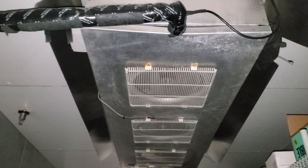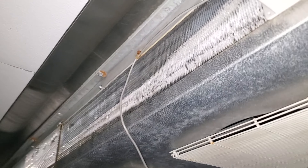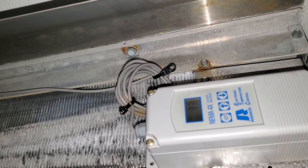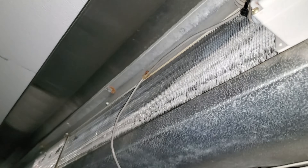We have been called on a walk-in freezer that's not working properly. The fans are running but it's just not cold enough in here. The coil is kind of iced up in a funky way too. That looks like a refrigeration problem to me — it says 33 degrees on the thermostat and it's set for negative 10. So the thermostat is set correctly.